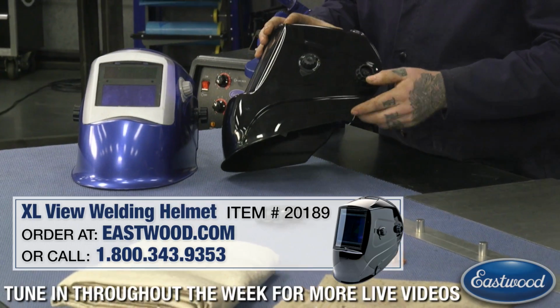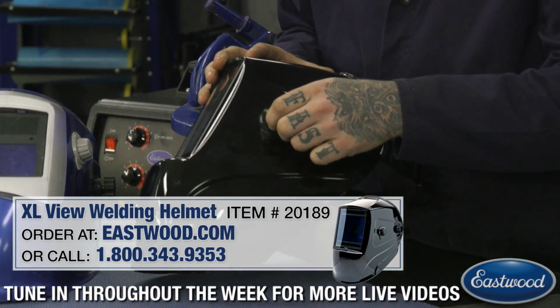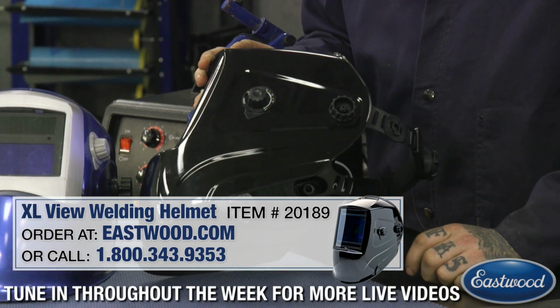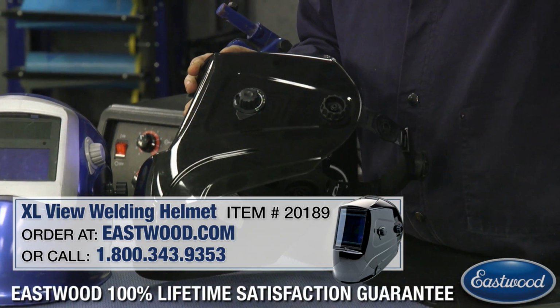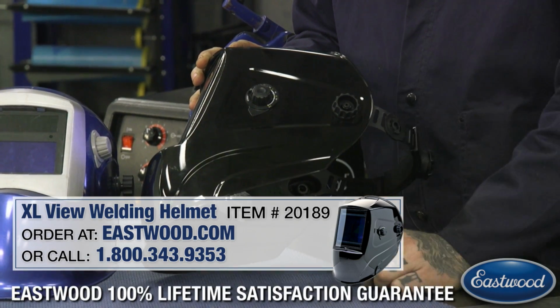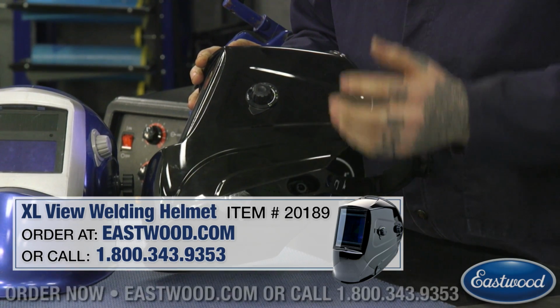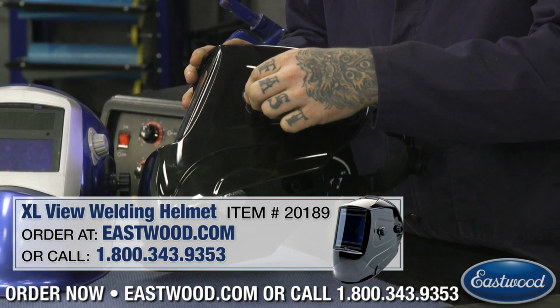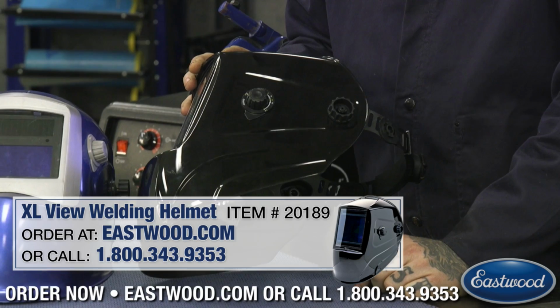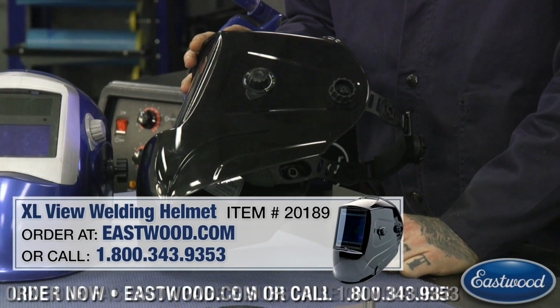Maybe Joe can get in here. A really cool thing on this one that saves you flipping up the helmet is it has a little grind feature on it, which is pretty cool. So you don't have to flip your helmet up and down if you need to quick grind something or adjust something. You can leave it on the grind setting and you can work. Your eyes are safe. And then you can flip it back up and turn it to your normal setting. Like if you were TIG welding, you got to do tungsten or something. Yeah, you can just leave it flipped down. You can do that no problem.